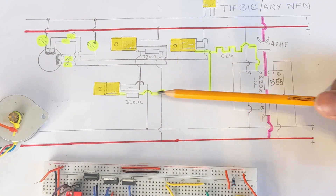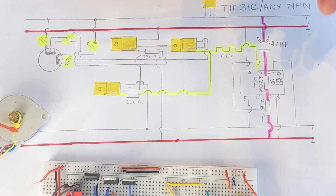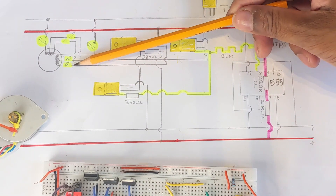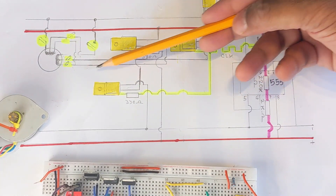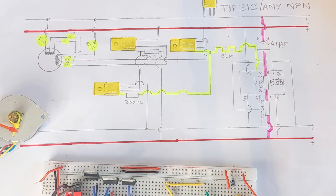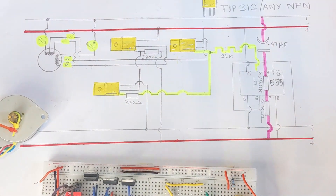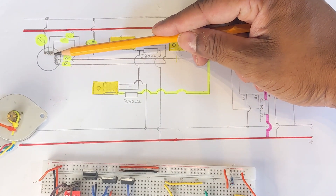This transistor is switched with an active high signal. The same signal switches both transistors on. When these two are on, one transistor provides power to one cable, while at the same time the other transistor turns off the second cable. And vice versa — when there is active low, the first transistor is deactivated, and the second one gets voltage and provides power to the other cable. This way, at any given time only one cable can be switched on, toggling between the two coils so they get excited one after another and the motor moves clockwise.